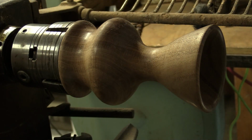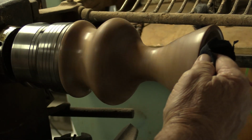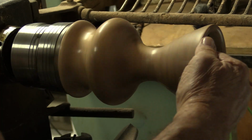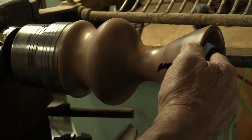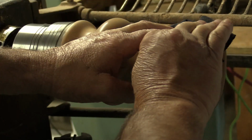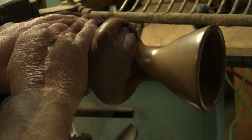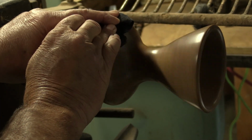All right, about 20 minutes has gone by. Now let's just start using, I use an old t-shirt, cotton, small piece. Like I said in previous videos, I never bring a large rag up to the lathe. You'll hurt yourself. So I just take my time, and we're going to buff this out. Now you can feel it grabbing. It's taking all that old wax off of there. I'm still pressing pretty firmly on this. Not super hard, but I mean firm.